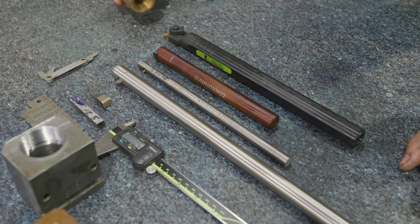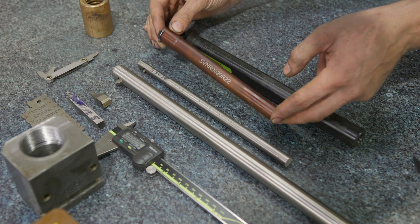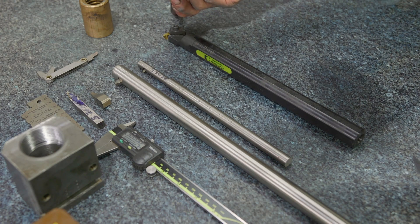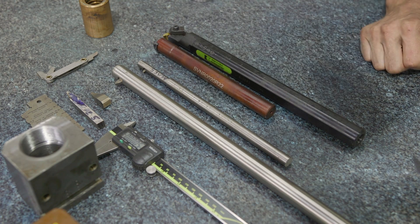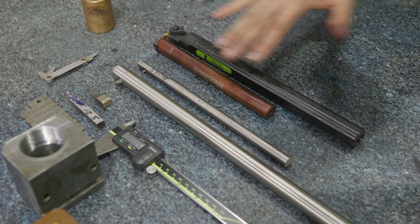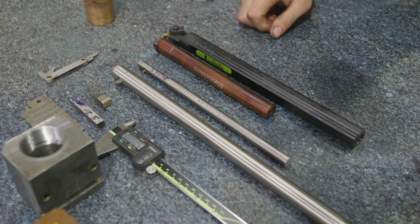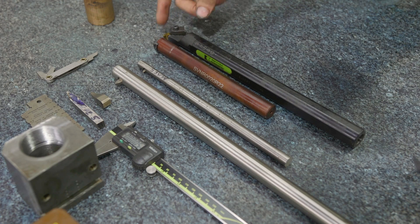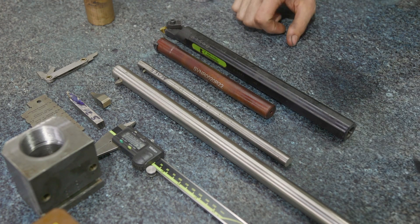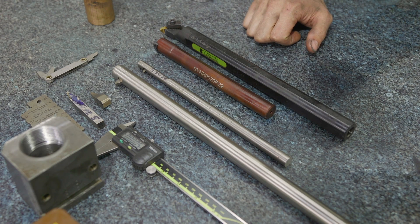The problem with these, other than being expensive, is clearance. A lot of these pre-manufactured Acme or internal boring and grooving cutters are pretty big — this cutter right here wouldn't even fit in this bore. This other option is a Chinese unit I found online that I thought I'd try, and it's smaller, with the insert mounted taking up most of the bar for a lower profile. But neither of these bars will actually work for making these nuts, because we need a left-handed bar and these bars are not for left-handed threads. The tool pressure drags against the insert backwards and wants to pull the insert out of the holder.